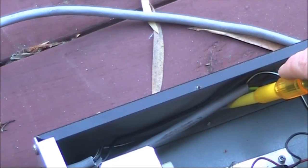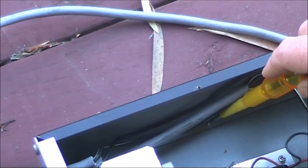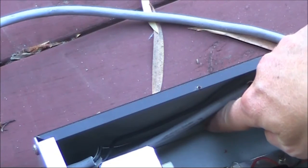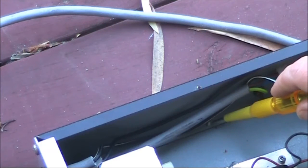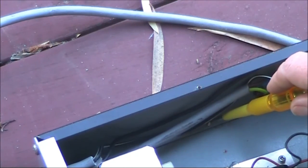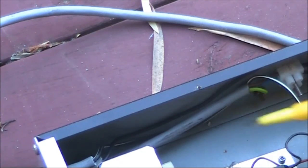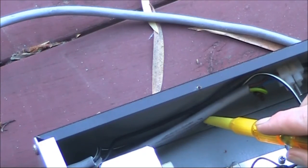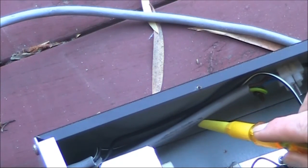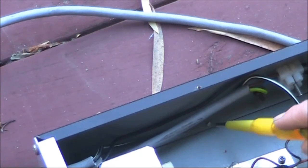The screws here are self-tapping screws with no nuts to hold them, and the front of these screws is quite sharp. It's important to ensure that no matter what you're doing, there's no possibility these screws could pierce any wire, particularly one carrying high voltage and current. This wire, which carries mains, is a bit loose, and you should really use a cable tie to bind wires together to ensure they don't slop around and could cause short circuits.